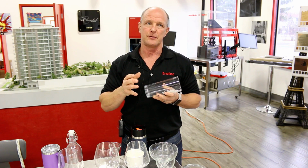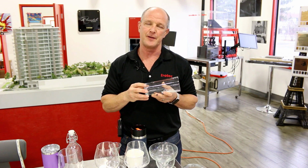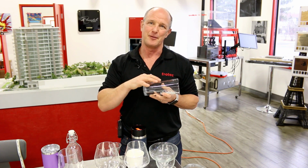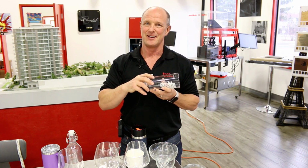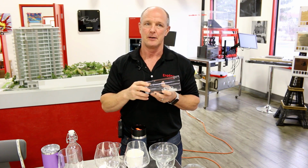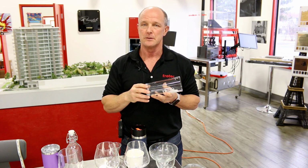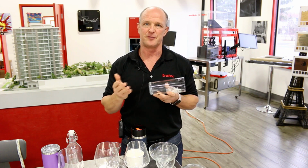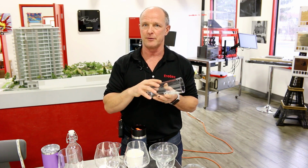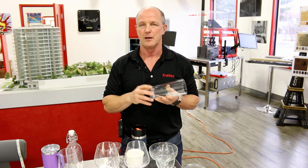The question that you need to ask yourself is then, if we don't have a page height anymore and we have a turn of the mug, how does that turn of the mug relate to the page height? And on a round item, that is the circumference. The circumference can be figured out a couple of different ways. We can just measure the glass all the way around, and we can figure out exactly what it is.